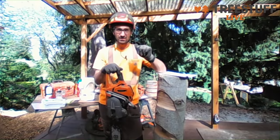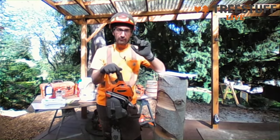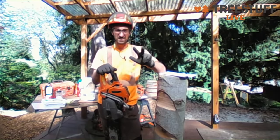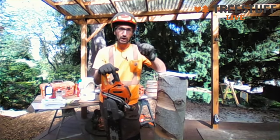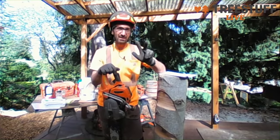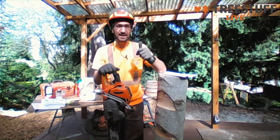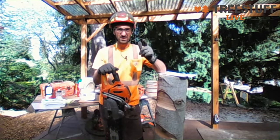90% of accidents involving the feller occur within the first 15 seconds of tree movement and within 5 feet of the stump. Let me say it one more time. 90% of accidents involving the feller occur within the first 15 seconds of tree movement and within 5 feet of the stump. So we can be much safer in our operations by one, getting away from the stump, and two, staying away from the stump.